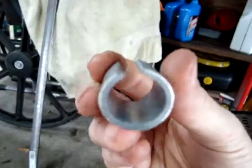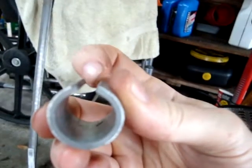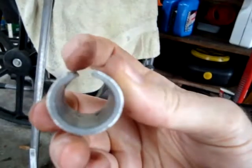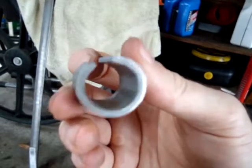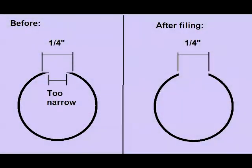One problem with this — if you look very closely, you'll see the gap between the two sides of this slot. It's a quarter inch up at the top; however, down at the bottom the inner diameter of the corners poke in a little bit where the metal got bent, and that's less than a quarter inch. Here's a graphic drawing of it — this is highly exaggerated — but to get the two corners out of the way, I had to file down the gap in the middle until the two sides are parallel.